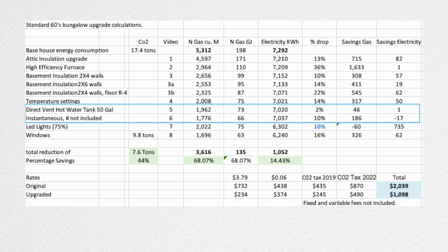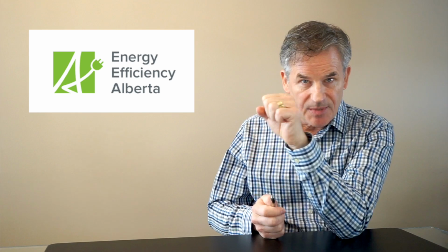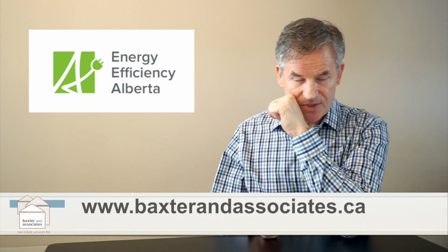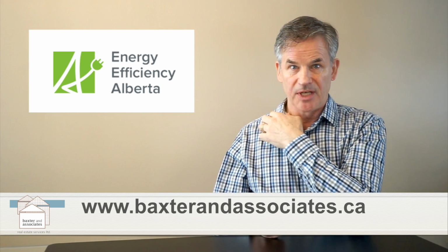So for me, in my house, I've just gone with the power vented water tank. Even with those bigger ones, you can do your in-floor heat with them, and they're reliable. You don't have to maintain them much. So my vote goes with those. A little bit more efficient, not as much savings as the demand system, but on the whole, I like the power vented hot water tanks. If you want to go with the demand system, Alberta Energy is giving rebates on those things. So if you're doing that, make sure you get your money from those guys.